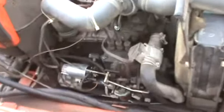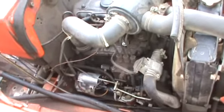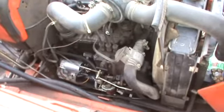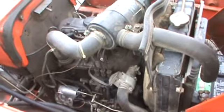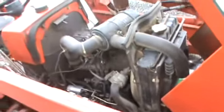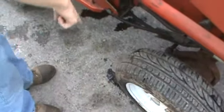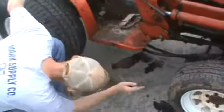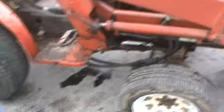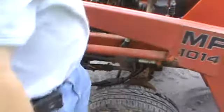You can see the blow-by. We aren't hiding a thing — I am showing you that. There is a leak here at this cylinder; you can see it. It has been sitting here for ten minutes and there is a leak at the cylinder — that cylinder is going to need to be repacked. There is a hose leak underneath that comes down for the valve. Pointing that out. This loader arm has had a weld repair right there. We are going to go ahead and shut the hood — it latches.